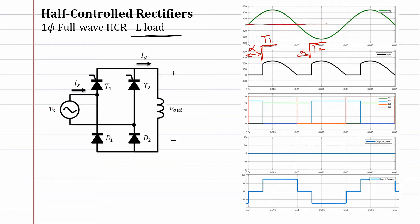When the voltage is positive, we expect that the current should move in this direction, but thyristor one has no signal at this point so it will be off. Once it's off, this will be an open circuit and the output voltage will be zero. At this point, thyristor one receives the signal and then current will flow directly in this direction, so the output voltage will be this portion.